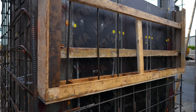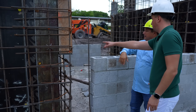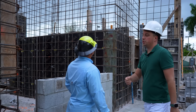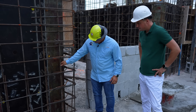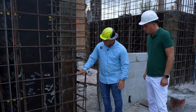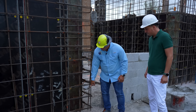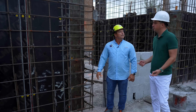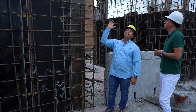And the first floor door. So this is going to be underneath — it's the elevator shaft. That's the first level and this will be your door. Lots of progress in two weeks. How do they place these rebars? They call it dowels. This rebar is tied to the rebar underneath, that's why it's strong. We only see this rebar sticking out, and you have to leave about three feet for overlapping with the one going up. Everybody is attached together from the foundation all the way up to the roof.